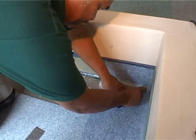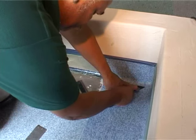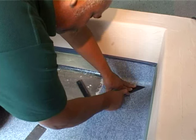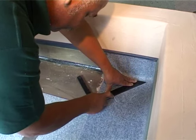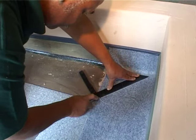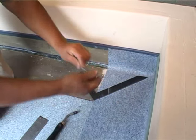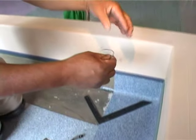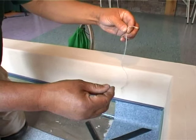Coved miters in the corners need to be hand grooved with a P-type groover, being careful to use a small steel straight edge to keep the joint straight and not too deep, and then welded in the normal way. From the video you can see that the groover takes off a tiny strip from each piece of sheeting, ensuring that it is correctly and centrally grooved.